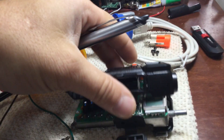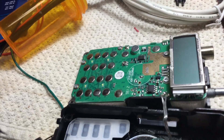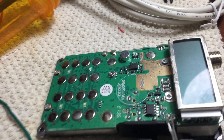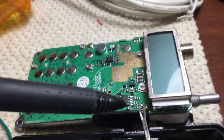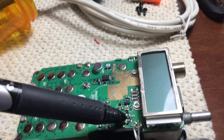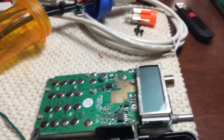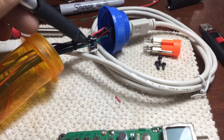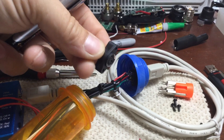So if I could rewire the jack — find out with an ohmmeter — I'll plug this in and put my meter on this lead and start testing these points to see which one it is. Once I find that, I'll figure out which one I can solder a jumper wire to. I've got to verify this, but I think it's going to be this one right here. So if I solder a jumper from here to here, then I can just plug this cable into the jack, and the center point of this cable will be my squelch line. Then I can take the squelch line from here and hook it up to the pin I need on this connector here.